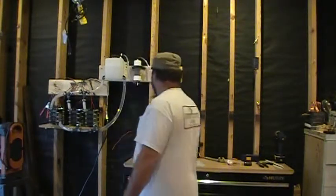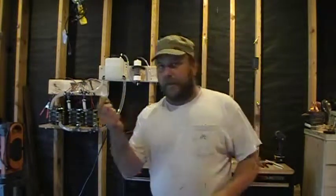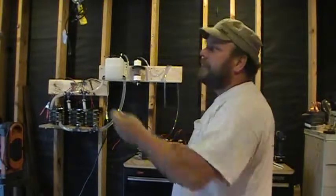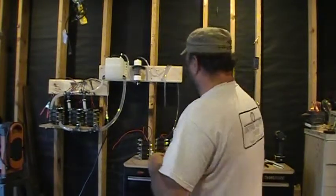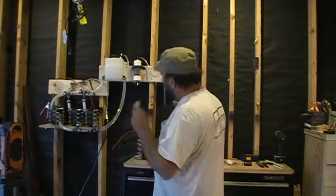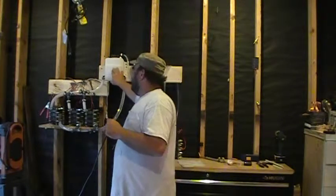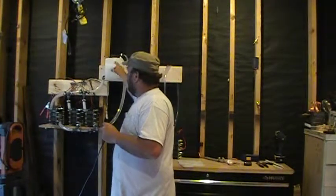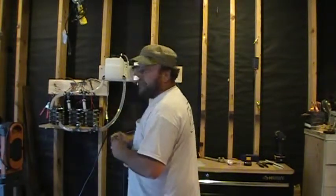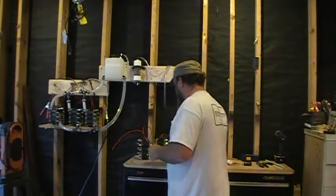And then come in and make sure you have a flashback detector if you're using torches, or let's say you had it hooked to your vehicle or whatever. But make sure you have a third flashback protector, because the last thing you want is for it to ignite in here if the water gets too low. Definitely it could ignite in here, but you never want it to ignite in your cells, because they'll blow your cells up and you totally lose your cells and all that hard work.